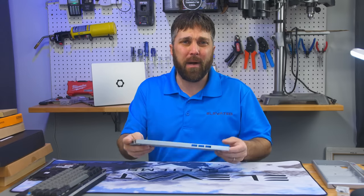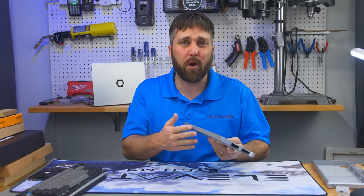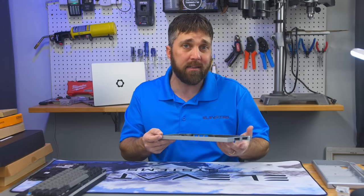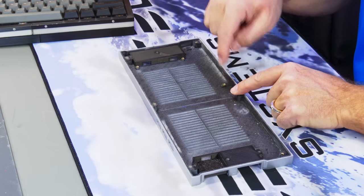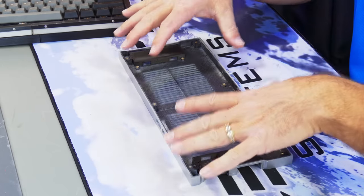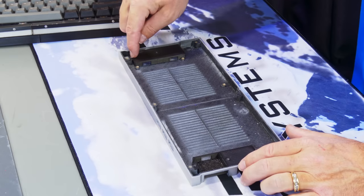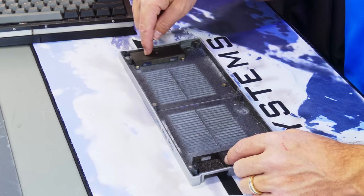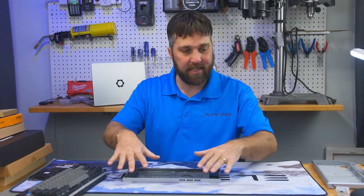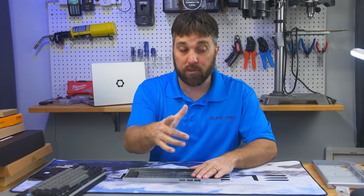So I already epoxy filled, sanded, and painted the part. I wanted it more camera ready this time. I added some threaded inserts for mounting the motherboard and the keyboard, and I tapped the tiny M.2 screw holes for attaching the expansion bay inserts. Let's get everything assembled and the main board installed in here.